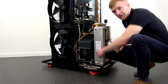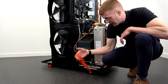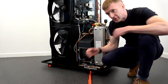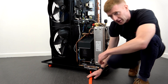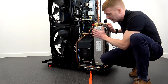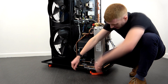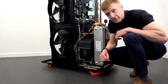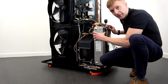Moving around to the side, I just want to point out there are two carry straps on this side and one on the other, just for lifting and putting the outdoor unit into position. This side is far heavier because you've got your refrigeration circuit and the compressor. There's also a transport bolt down there that will need to be loosened off to free up the refrigeration circuit and the compressor.